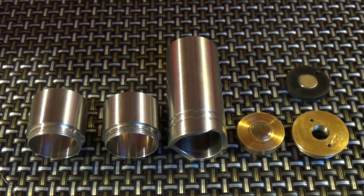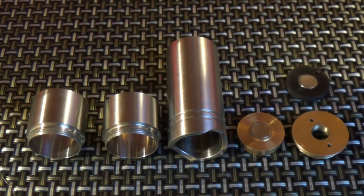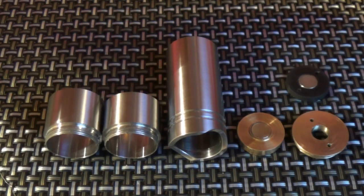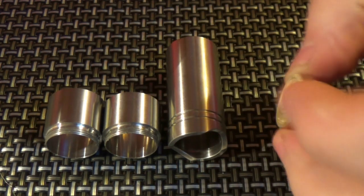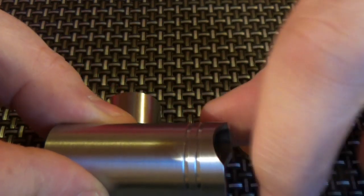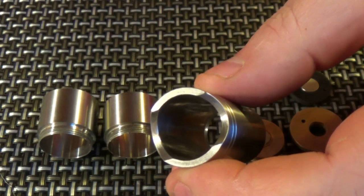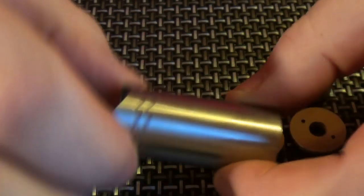Right, let's go down and have a close up. Now, this comes boxed — mine came in a little black box, and this was everything that was in it. Tubes: 18350, 18500, and 18650 — so that's your 18500 and 18650 extensions, and your 18350 tube. Your top cap — brass. Your button, which is brass with a magnet in it. And you have this magnetic spacer that goes in the bottom of your battery. So it's 303 stainless steel. You've got these cut-outs for putting your finger in when you want to fire the button. They're quite solid tubes — in fact, they're 2mm thick. There's quite a little weight to them, they're dinky but there's quite a heft.